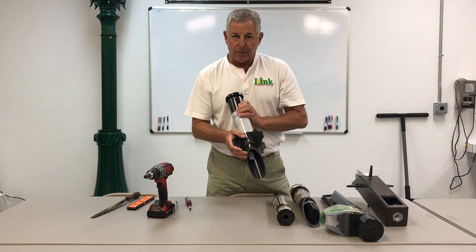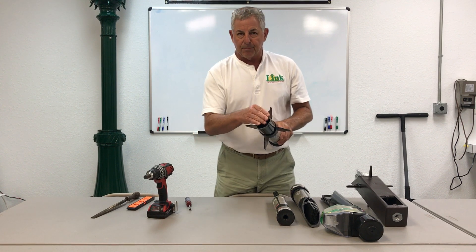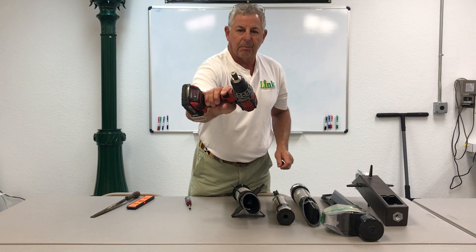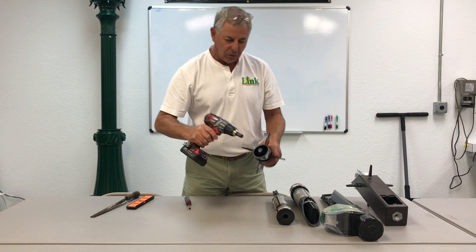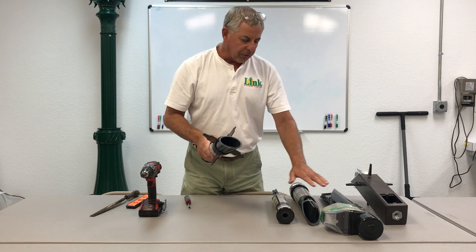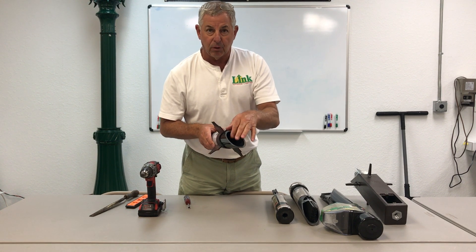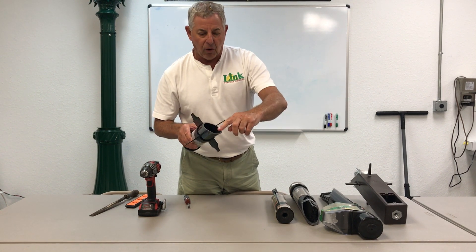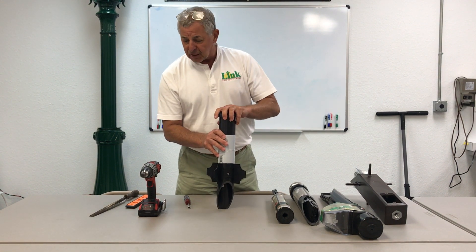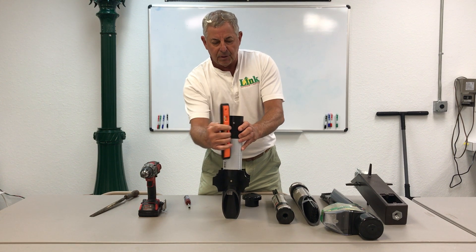You don't have to bury it with the wings, but I do recommend it. Most importantly, before you bury any of these, take a rasp bit in a drill and put a chamfer on that edge. They use a chop saw to make these and all brands are the same — it leaves a very sharp edge. If you want to save yourself problems down the road with cut wires, round that edge off all the way to the end, making it nice and smooth with a clean bevel.